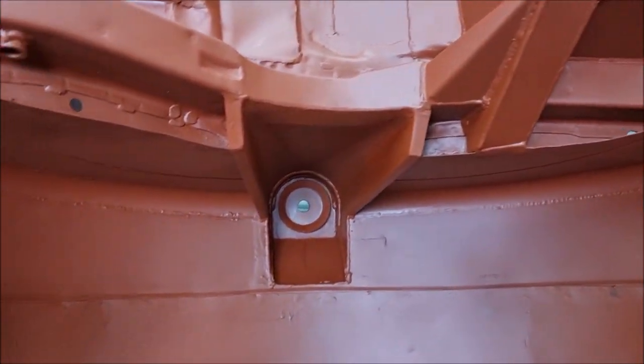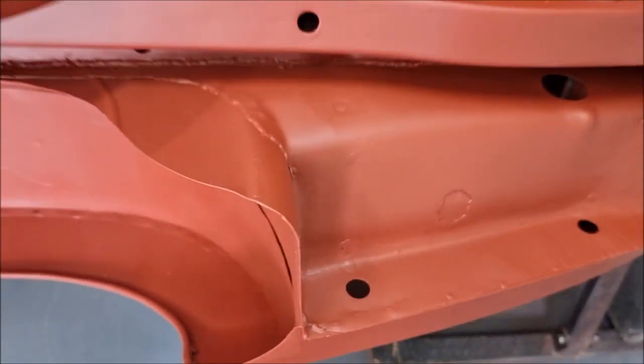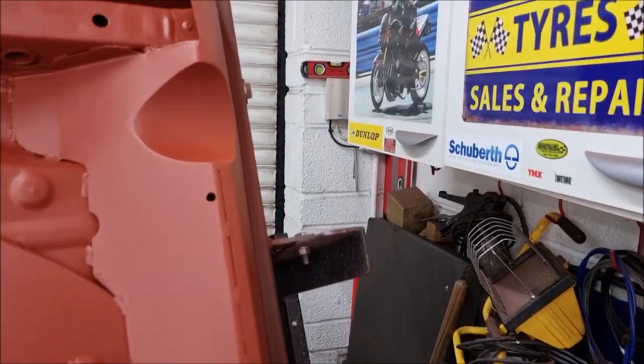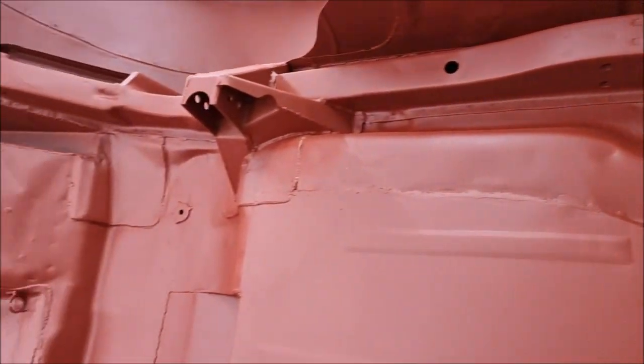The rear suspension turrets are up in the wheel arches. Again, the rear arches have been rolled. I don't know if I can get the camera up there. You can see there's a 1/4-inch rod in there, and then the wheel arch has been fully rolled and then stitched over. There's a rear valance skid. Again, I had to put a divot in that for the rear exhaust.